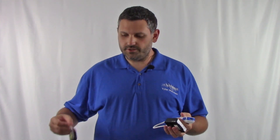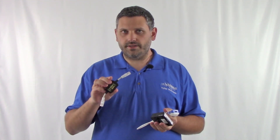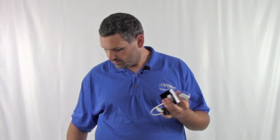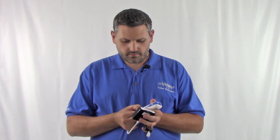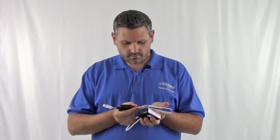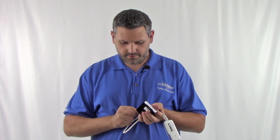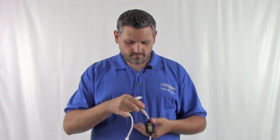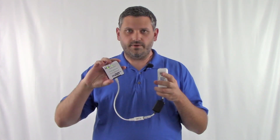Optionally, we offer a 24-volt to 48-volt converter. It has input and output on all three sides. Input goes into your PowerLink; output goes to your 48-volt device. On longer cable runs, I recommend using an RJ45 coupler. Here we'll demonstrate 48-volt conversion — connecting input and output — and as you can tell, we are getting 48 volts.